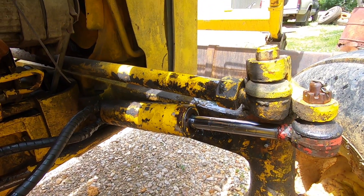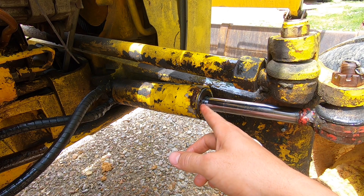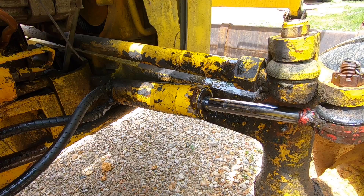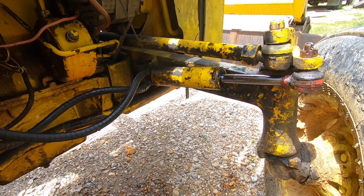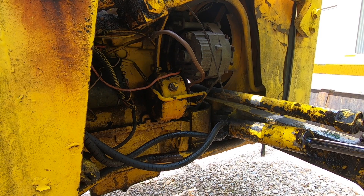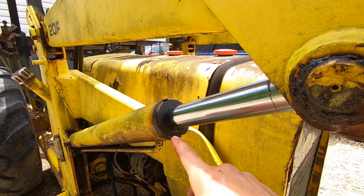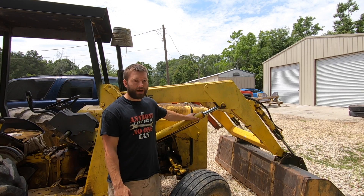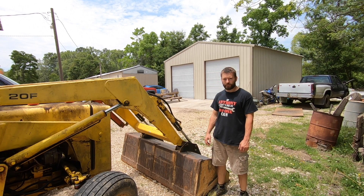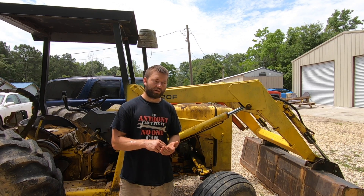We can see that our power steering is working correctly and our new wiper, packing, and o-rings have stopped the leak. My power steering is now nice and tight and I don't leak any more fluid from that location. After my third refill and moving the tires left to right max to max, my fluid level stayed full. It was a little bubbly so I'm going to let this sit for a few hours to let the aeration out of the oil. I do have a massive leak from the packing on another ram, so stay tuned to our channel if you want to learn how to repack the lift ram bushings and bucket tilt packings and wipers. Thanks for watching — if you enjoyed this video please give it a thumbs up, subscribe, and always remember: dude, we can fix it.